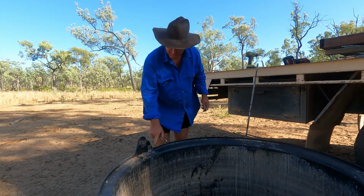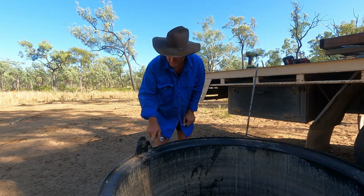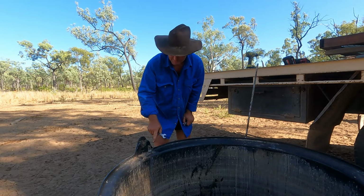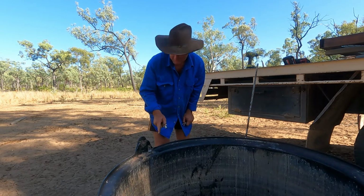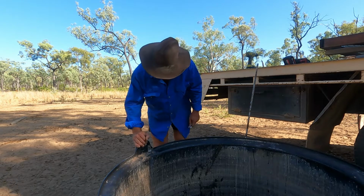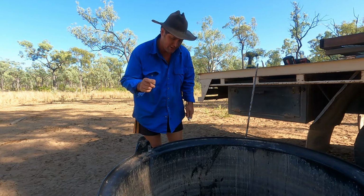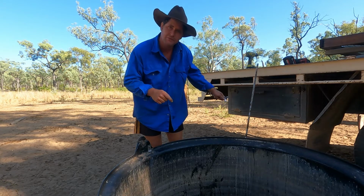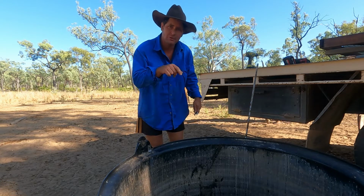Okay, so I've just used a bit of stainless flat with stainless steel bolts. You got to have stainless, otherwise it just rusts out too quick with the lick. So rightio, that's got that pretty good now. So now we're going to put a new sleeve on the shaft, and we'll put the ball back in.